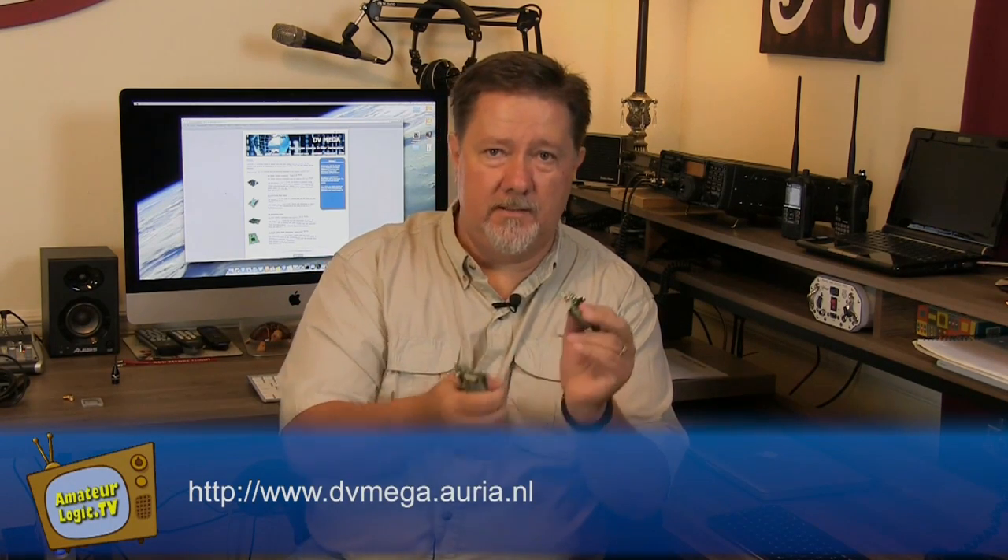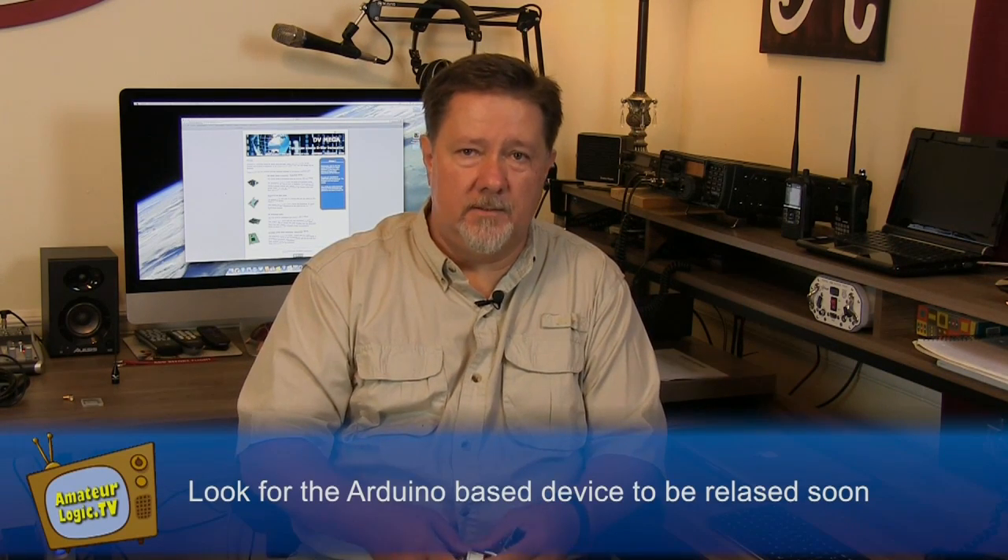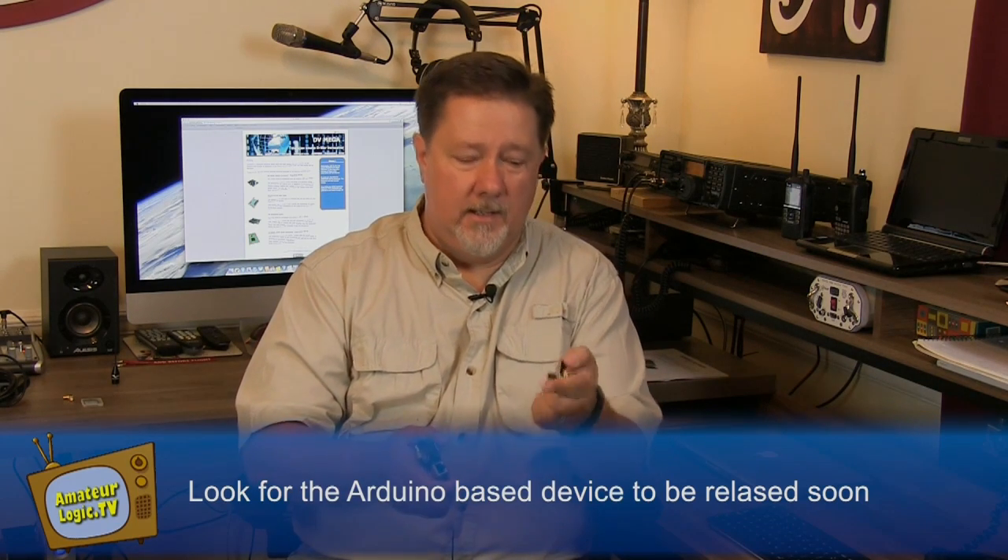He's got the UHF radio that plugs onto a Raspberry Pi, hooks onto the GPIO pins, and there's a little standoff to secure it, and a small SMA adapter to hook your antenna on. This is very similar to the DV access point functionality — this one's only UHF; there's not a two meter version that I'm aware of just yet. He also has another device that hooks onto an Arduino — it's a shield, basically the same functionality, but it's actually a dual band radio, which is very cool. These devices are fully supported by Jonathan Naylor's G4KLX software.